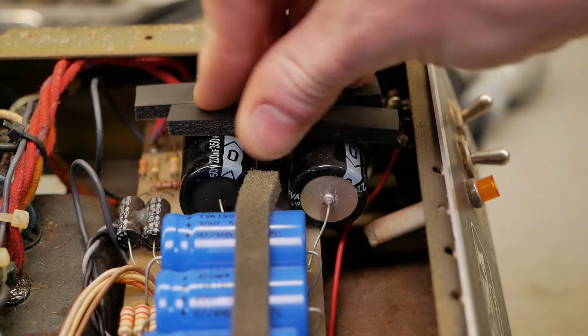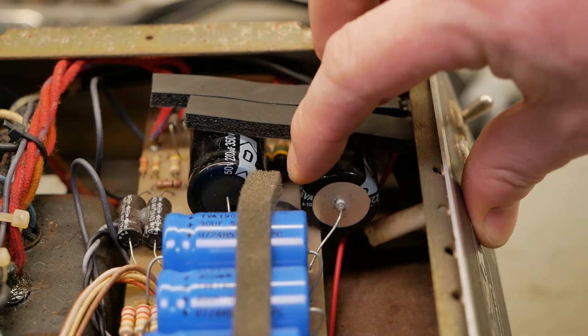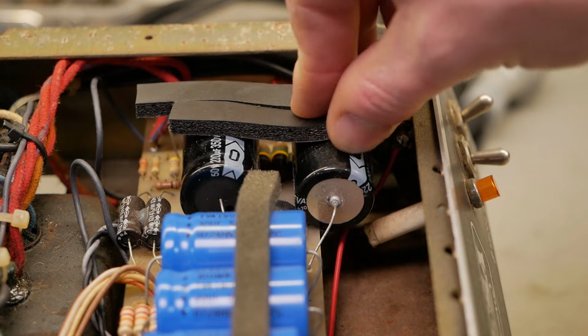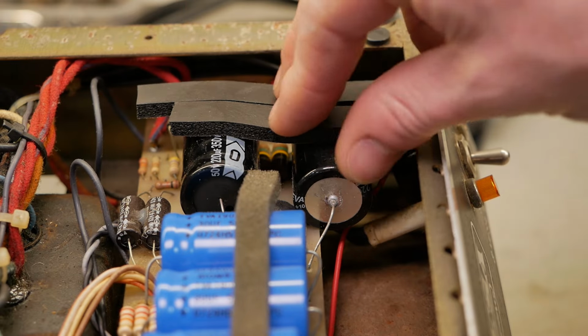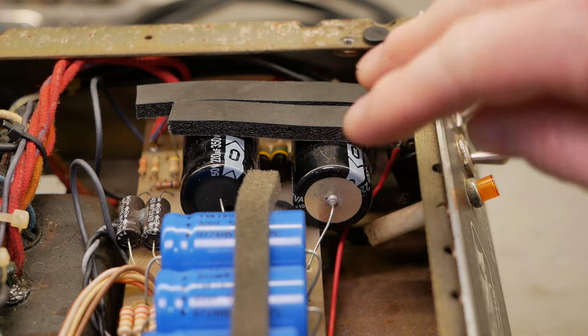No biggie, I've used them before in a pinch and they're fine, but the mounting of them leaves a lot to be desired. They're hanging off the edge of the board, which is just inexplicable. No silicon there. You've got some resistors hiding down in there, so that makes it a bit annoying, but you could have used some silicon or something. This is dodgy as. You're just asking for a fractured lead or fractured solder joint.